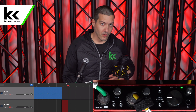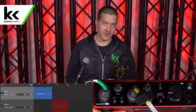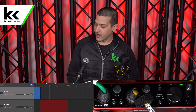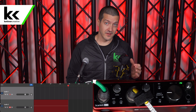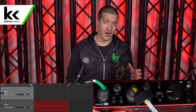Okay, so now we're recording the condenser microphone but as you can see we are getting no signal whatsoever out of it. You can hear my lav mic clipped on right now, but as you can see in GarageBand there is no movement, there is no power. It's not like this microphone sounds bad without phantom power — you just cannot hear it at all. It will simply not work.